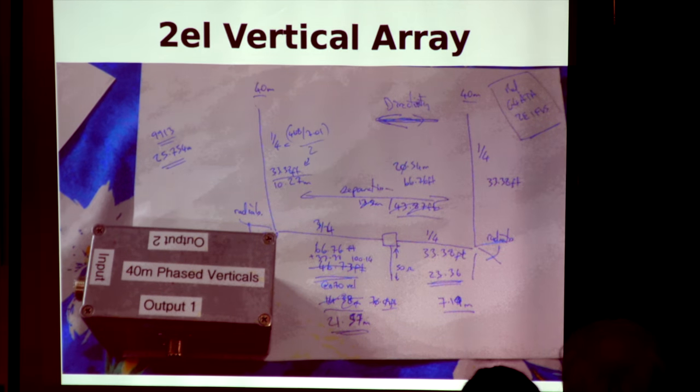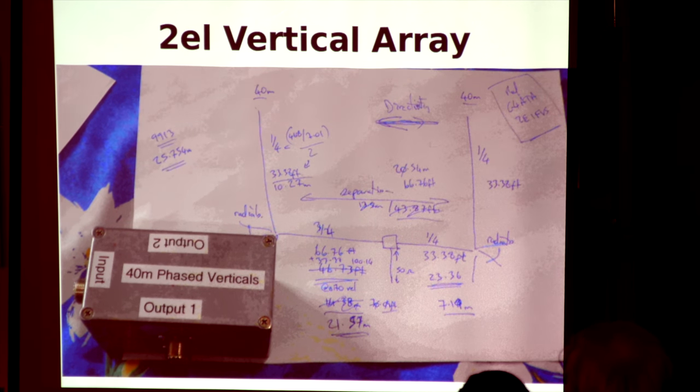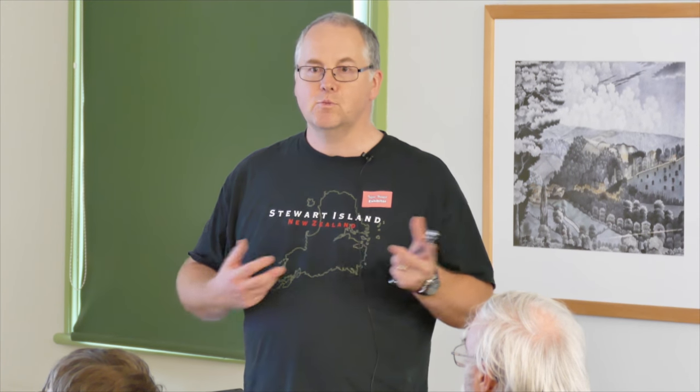The talk title is about making antennas when somewhere else. I reference G4ATA and 2E1FES for this one. If you've got one single ground plane it's 360 degrees. But put another ground plane within the near field and it starts to become a parasite — you can move it around and get advantages in one direction or another.